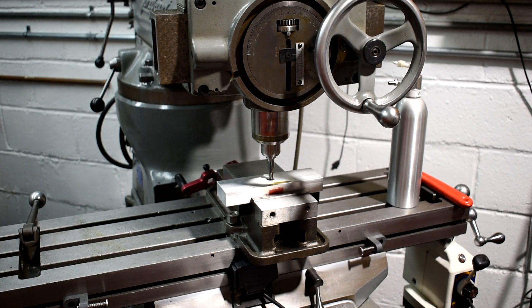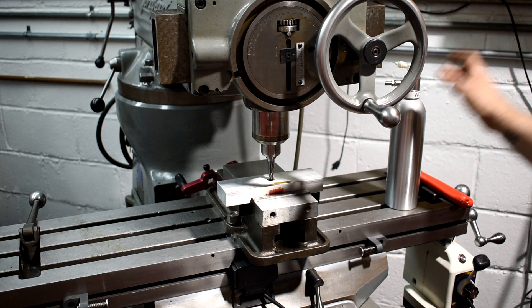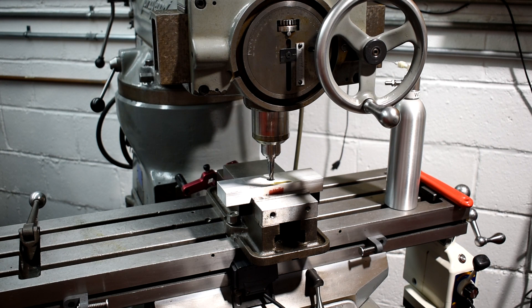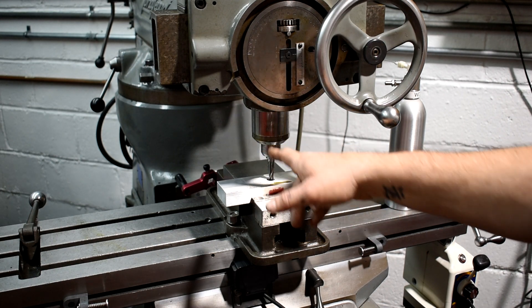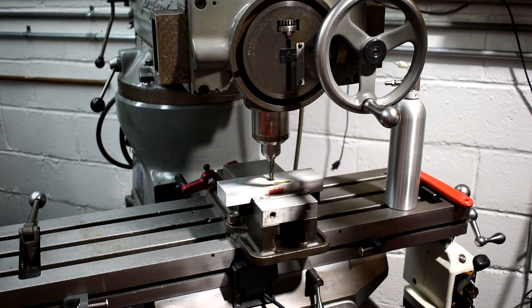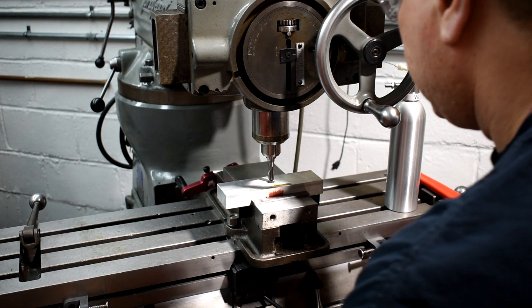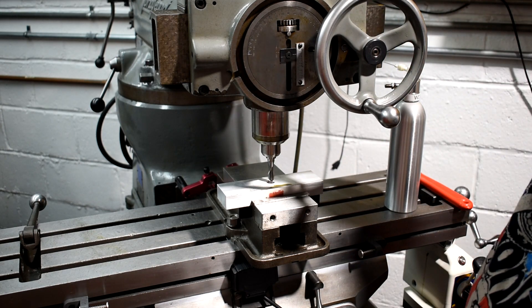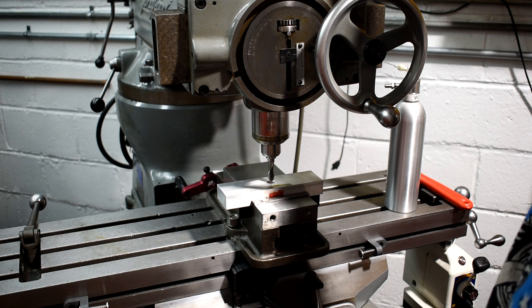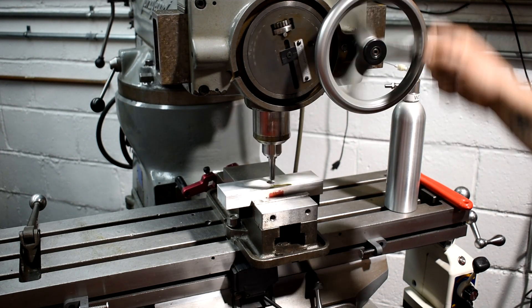I'm centered on the part — the part's tightened and I have some WD-40 to keep it lubed because it's aluminum. I locked up my X-axis since I won't be needing that; I'm just going to be using my Y to traverse front to back. The vise is on backwards because I had to bring it out a little bit further. I think I'm just going to be working the Z-axis — obviously you can see there's no adjustment on the actual spindle, so that's the only motion I really need. Let's give this a try and see what happens.